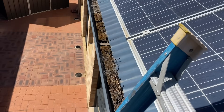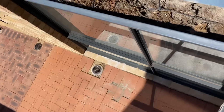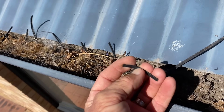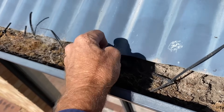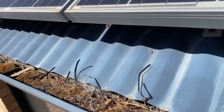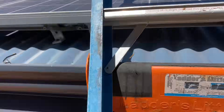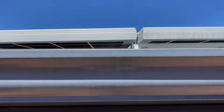You can see all the old cable ties in the gutter that they've used to secure the cables. I'm not allowed to use plastic cable ties because they just go brittle and snap, and then all the cables end up lying on the roof — and then you can get isolation errors where you get water ingress. As you can see they're all just lying in the gutter and on the roof, which may give them some problems in the future. Terrible install.